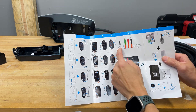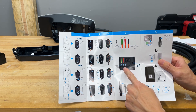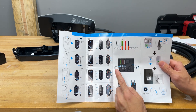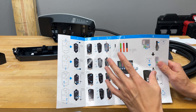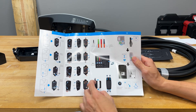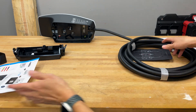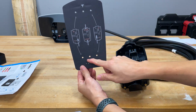You need to strip the wire about half an inch, or about 13 millimeters, insert it into the terminals, and torque it to 50 inch-pounds, which is 5.6 Newton-meters. I would highly recommend using a torque driver, because on stuff like this you must have a solid connection — otherwise it's a fire hazard or melting plastic hazard. After wiring, you mount the wall connector to the base plate, put the four screws in, click the breaker on, then scan the QR code to connect it with the app.